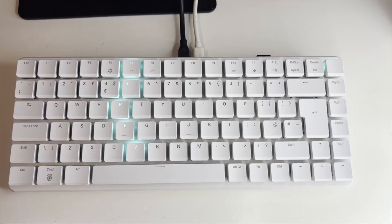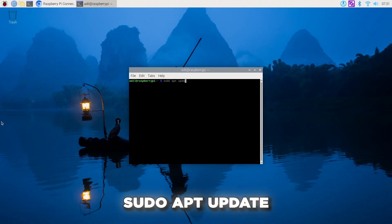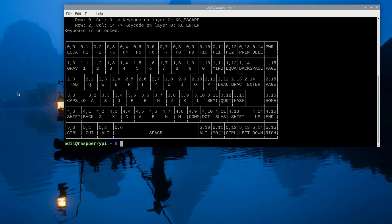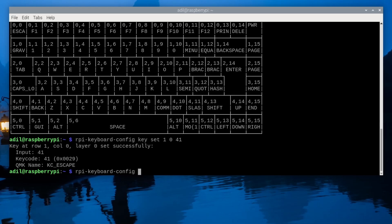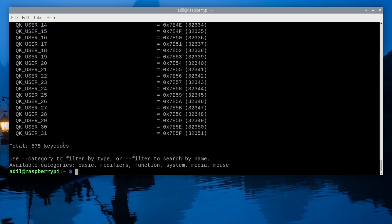Here's where the Pi 500 Plus gets really special. The keyboard itself runs on an RP2040 microcontroller, making it fully programmable. Install the configuration tool by running: sudo apt update, then sudo apt install rpi-keyboard-config. To get info about your keyboard, type: rpi-keyboard-config info --ascii — and you get a full ASCII layout of your keyboard. To remap a key: I almost never use the grave accent key, so let's change it to Escape. Looking at the map, grave accent is at row 1, column 0. The keycode for Escape is 41, so type: rpi-keyboard-config key set 1 0 to 41. Just like that, grave accent is now your new Escape key. You can find all keycodes by typing rpi-keyboard-config list-keycodes. If you make a mistake, rpi-keyboard-config reset-keymaps brings everything back to default.